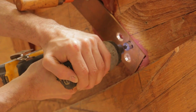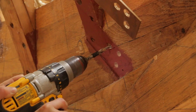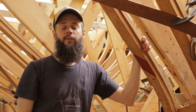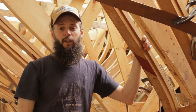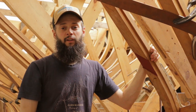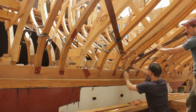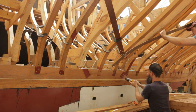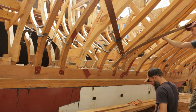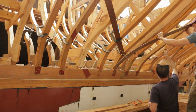The paint has dried, so it's now time to install the hull strapping. We're going to screw the bronze strapping into the notches in the back rabbet, and they'll be clamped into the grooves on the frames. Once we get to that point in planking, the planking fasteners will go through the plank, through the bronze, through the frame, and tie everything together. For now they just get clamped until the planks get that high. All we have to do is put them in place, drill through the wood, pull the bronze straps back out, put in a little dolphinite, and put the screws in to finally fasten them.